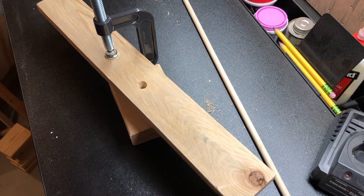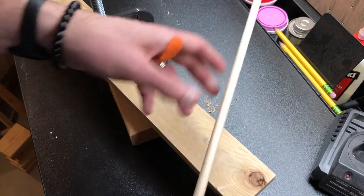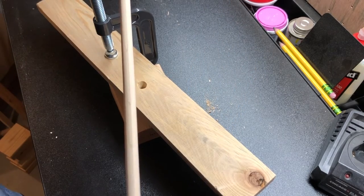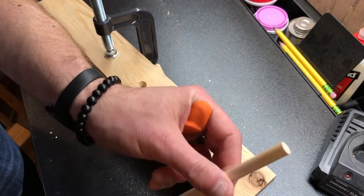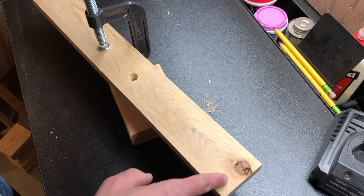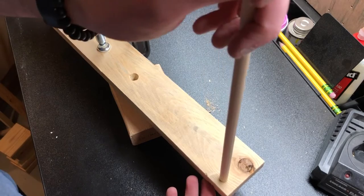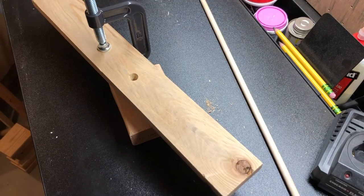I'm going to attempt to drill some plugs for my neck — for the holes that I screwed up. I had the thought of using this maple dowel rod that I bought for another guitar neck. I saw a guy on YouTube — T Woodford, from Woodford Instruments — and he used a three-eighths diameter dowel. It's pretty thick if you're considering putting that into the back of your neck four times, and the holes are fairly close to the edge of the neck, so I don't want to run the risk of going out into the edge of the neck with a three-eighths size dowel.